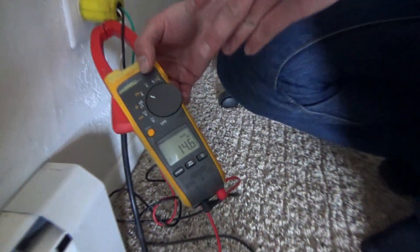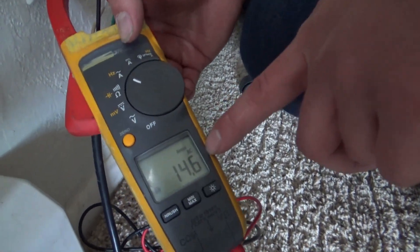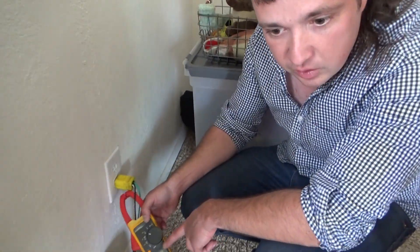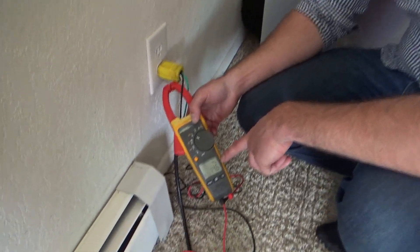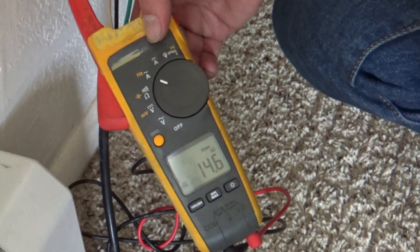As you can very clearly see on the multimeter, our machine is running — it's drawing just shy of 15 amps. So you can set this up on any 20-amp circuit without any problems. I would recommend setting up the power supplies and the pump and the fan on two separate circuits if you're running it on 110.